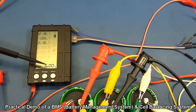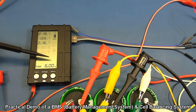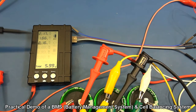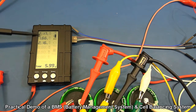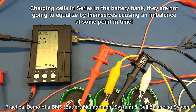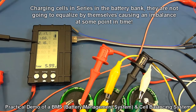It's showing around six volts, so for all intents and purposes, if we weren't aware of the potential issues at the individual cell level, we'd be happy because our battery bank would be at the right charge level. But looking at individual cell voltages, if our maximum voltage for each cell was two volts, we have a problem — two cells are over the voltage maximum and one is sitting below because they haven't been balanced. When charging cells in series in a battery bank, they're not going to equalize by themselves, and at some point you're going to have a cell imbalance.